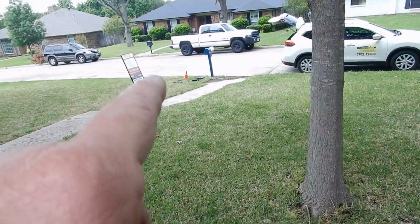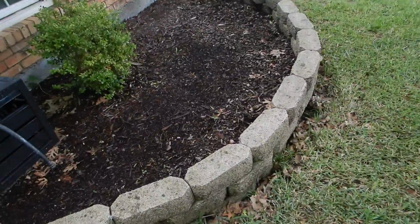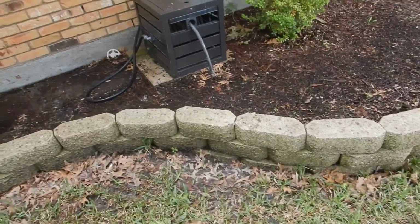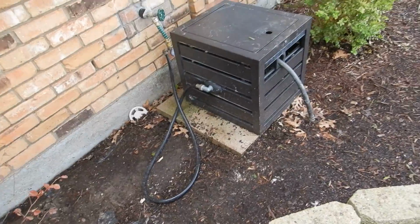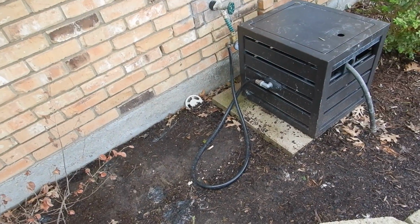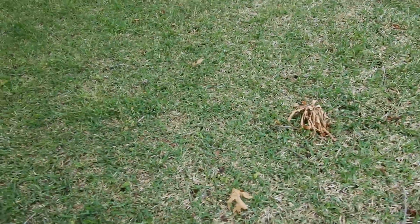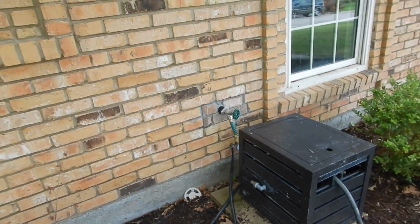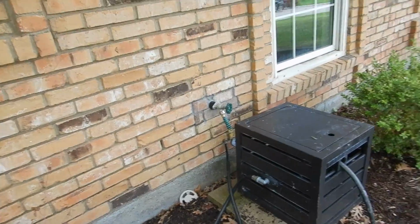Off of the meter, or wherever the main water shutoff valve is, a main water shutoff valve should be installed with a backflow prevention device, and those valves have regulators on them, and you can dial down the pressure so that the house isn't stressed out. A lot of people say you can't get too much pressure. Well, yes, you can. You can get too much pressure. And what you're really looking for is flow. You're not looking for pressure. You want a lot of water to make a lot of suds so that you get really clean. But you don't need pressure. You don't need it to remove your tattoos. You just want to get clean, and fill up your tea jug or coffee pot in a reasonable amount of time. And the bathtub too. Don't want to wait too long for that.